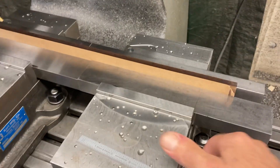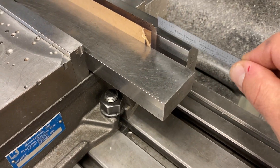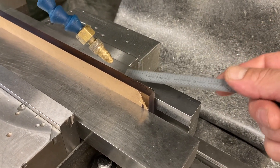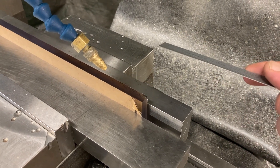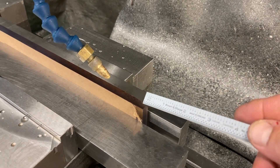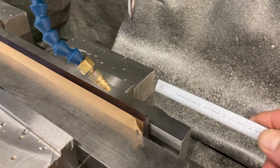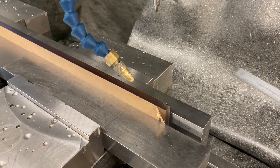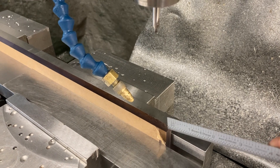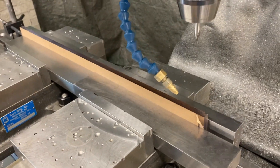When I edge found the part, I peeled the protective plastic back on both sides so I know how thick that plastic is — the protective paper is about four thousandths thick. So when I edge find the back I zero out my DRO, move a hundred thousandths for my edge finder, zero out, then move four more for the thickness of the paper. The centerline of the hole is 188 thousandths from the edge. It's only four thousandths, but if it did make a difference, that's how you do it. I peeled it off on both sides to measure how thick it was with and without the paper, so I compensated for it.